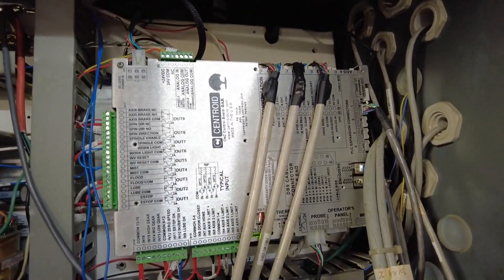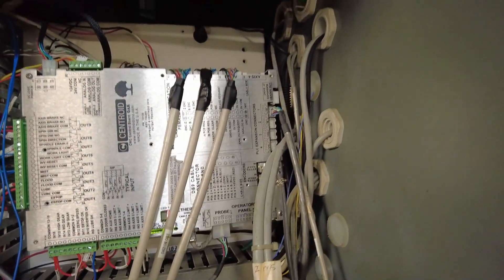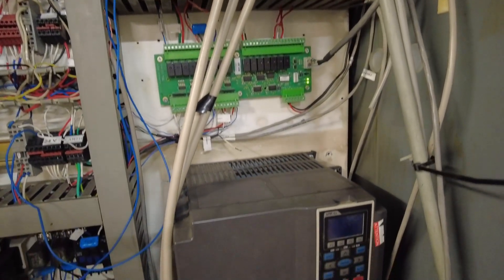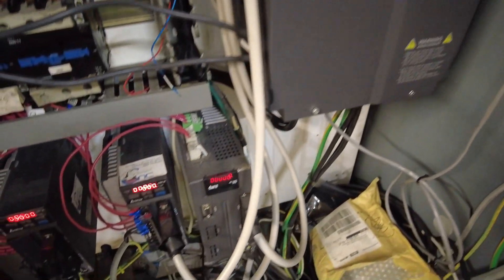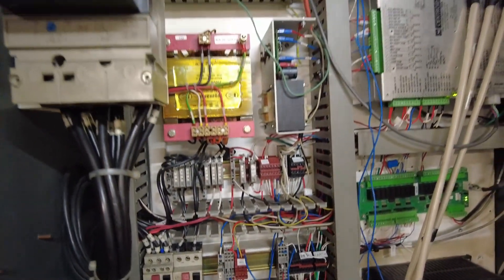What things are you going to need for your CNC retrofit? You're going to need the components for the brain — the controller. All I can speak to is Centroid, and I cannot say enough good things about Centroid. I love my Centroid retrofits. You're going to be looking at about probably two grand for the board. You're going to have to pay for software, which will be maybe seven hundred to a thousand dollars. The MPG and a probe, if you want it, you're looking at maybe another fifteen hundred there. And then don't forget about all of the things you'll need during your retrofit — you're going to need a bunch of wire, contactors, snubbers and things like that, wire guides. There's a lot of things if you want to make it nice that you're not going to be thinking about. So figure in a little bit of extra cost.